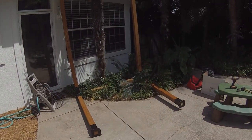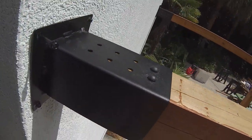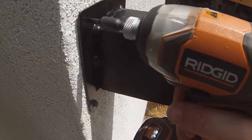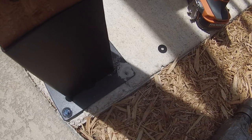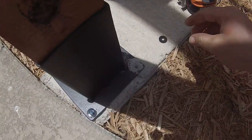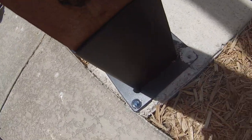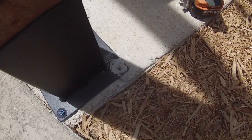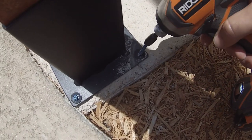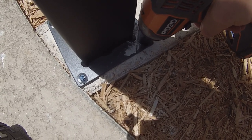This was helpful with a couple of strong bodies — I'm going to see if my camera crew can help out. As you get it all set in place to the wall, you either need to put up a ledger board or make sure you're going into studs, then anchor it with a ledger-grade fastener. In this case, you want to pilot drill concrete holes. We had spray painted some washers black just to make them look better. You want to get the washer fitted onto the screw — it's a Tapcon concrete screw. Clean up the dust, then tighten that in — just tight enough, not too tight.